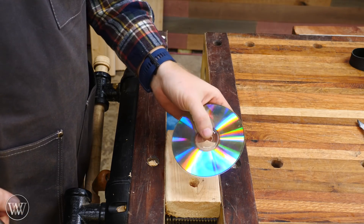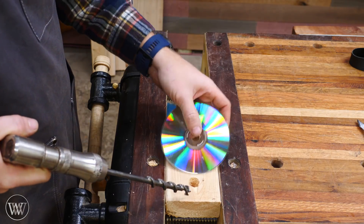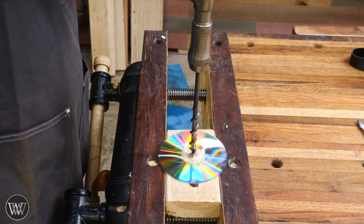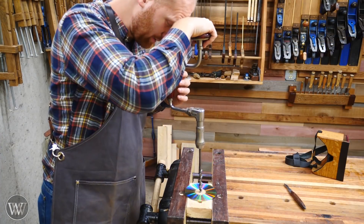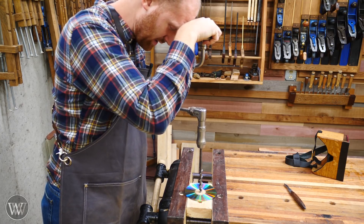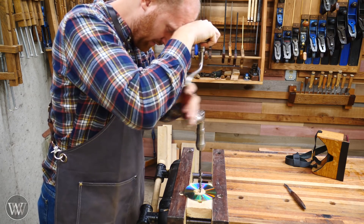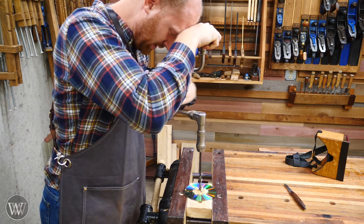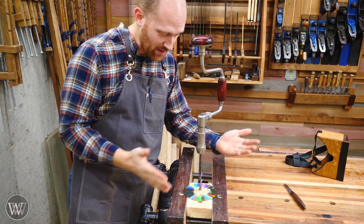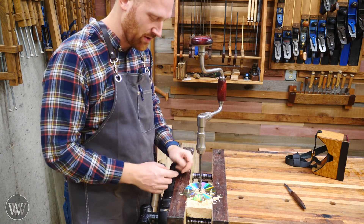For the second tip, you just want to get an old CD. This is a lot like the saw trick where you're looking in the reflection to make sure you're sawing straight. You put the CD down where you want to drill, put your bit in there — if you're using a larger bit you may need to pre-drill out the CD. Then I can put my head on top and as I look down the bit I can very easily see if I'm leaning left or right, and also if I'm tipping back and forth. I can make sure I drill a nice clean hole by looking at the reflection all the way down. Just looking at that reflection I can easily see if I'm out of plumb or out of square, and I can make sure that hole is nice and square to the surface — all from just a CD.